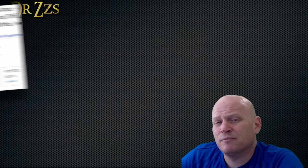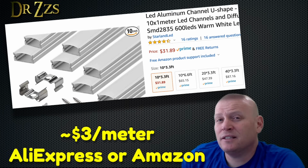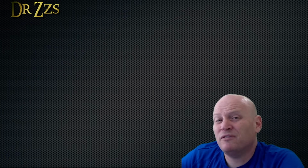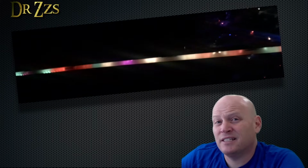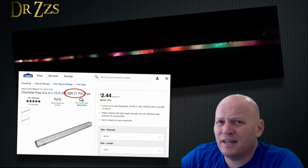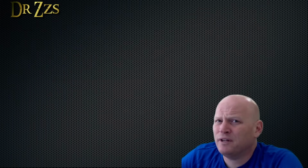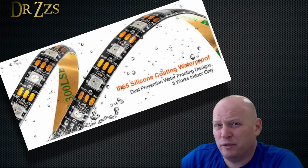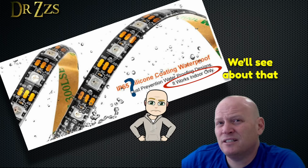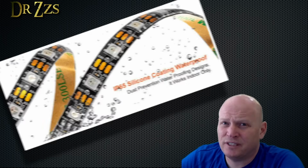If you go with the strips, you could use this aluminum channel with a light diffuser. It looks nice and costs $2 to $3 for 3 feet. Some folks have used PVC pipe and slid the LED inside of that. That costs about $2 for 10 feet. I was kind of surprised to see the LEDs shine through the PVC pipe, but they do. It actually works pretty well. If you go with the waterproof strips, you may not need anything else for mounting if they have a good adhesive backing and you have a good, flat, clean surface to stick them to.